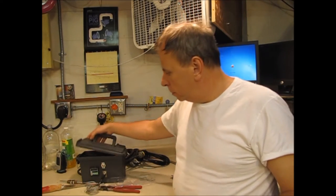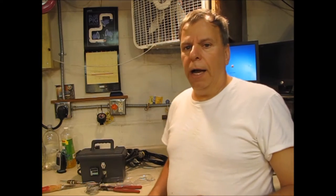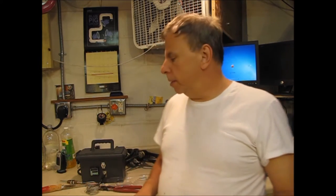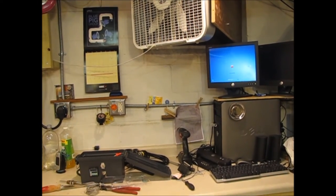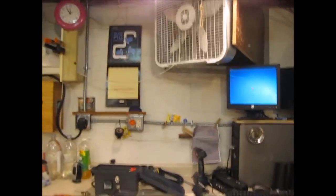Quick update on my brew controller. I used it this weekend to control the heating element in my electric smoker — worked really well, got the temperature right where it needed to be and kept it there. Problem was it was pretty warm outside and I had left the cover closed. After running it for two or three hours, the SSR — the solid-state relay — overheated a little bit and it kind of melted. Let me take the camera off the tripod and give you a look at what it did.